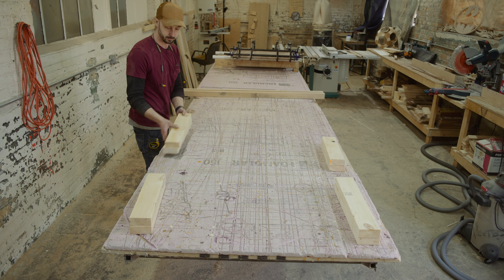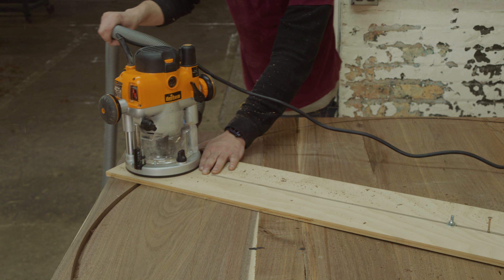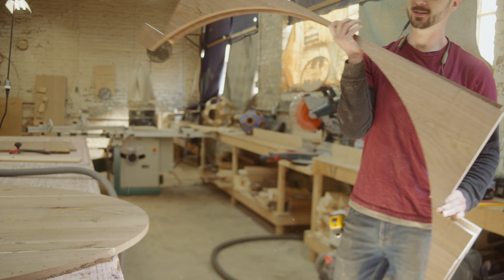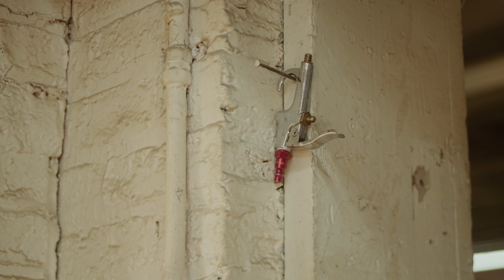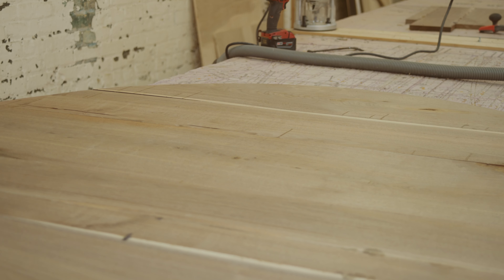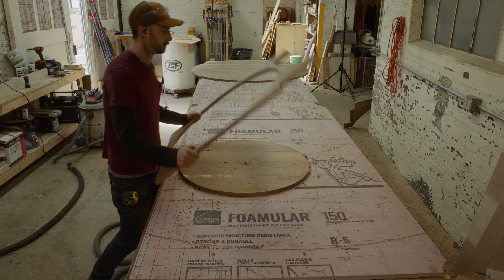I realized I probably didn't have the right bit — it needed to be a straight bit. I did have some issues with the bit when cutting out the circle for the dining room table; it just kept pulling down and out of the collet, and I think the pivot screw was just a little bit too small, causing it to bite harder than needed and pull itself out completely. I've since changed that pivot screw and that problem is no longer a thing.